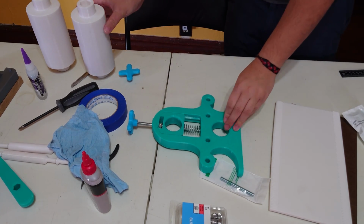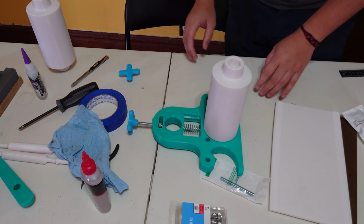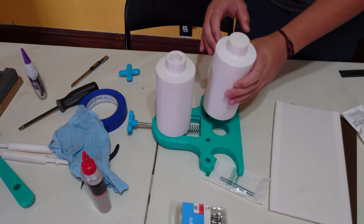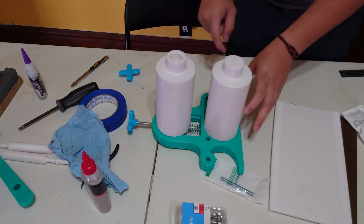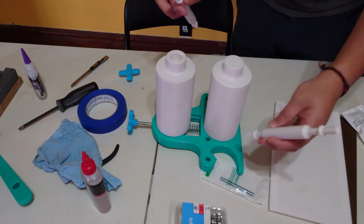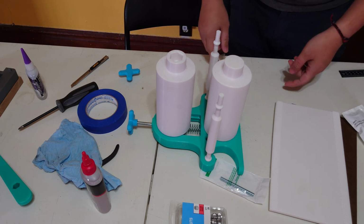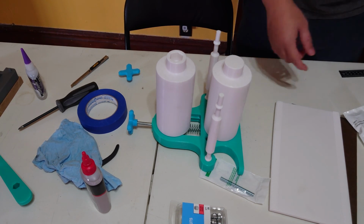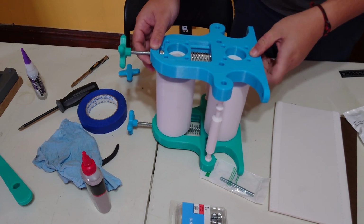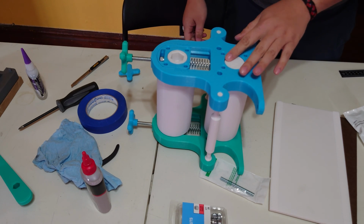We're going to take a press half and set it with the inside facing up. Decide if you want your press to be top or bottom driven and put the hex key in that oriented side, and then the non-hex key version in the other side. Then we're going to take our little press bed supports and stick them in these two outermost circles. Ignore the two in the middle right here; I took that out of the final design. Then you're going to take your final press half with the outside facing outwards and just sandwich it on, and it's about as simple as that.